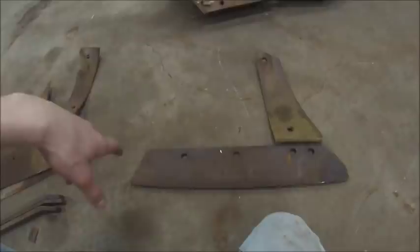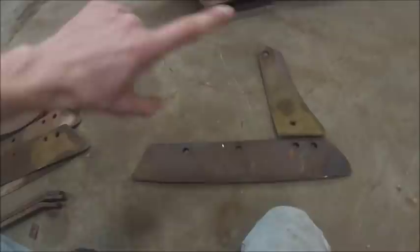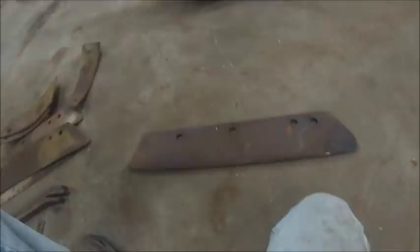So anyway, like I say, back in the days when you had two-piece bottoms, you had a moldboard and you had a point. The reason they called it a point was because when you had all three pieces as one, it obviously formed a point. Well, you take the land side part of it off, and you take the shin off, you got a share. However, everybody still calls them points, so technically they're shares, you're still gonna hear them called points.